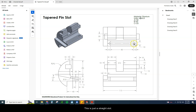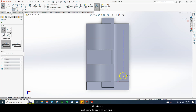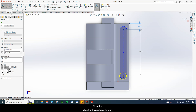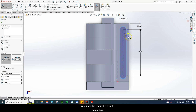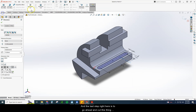The last bit we have to do is this cut right here — it's just a straight slot. You can see it's 80 millimeters wide, 10 from each edge, 10 millimeters wide. We can also see another dimension: 10 from this edge to the center. So we have lots of 10s here. Sketch, draw this in, and put some dimensions on: this is 80, this is 10. We don't even need to put that last dimension on because this is already 90, meaning from here to here should automatically be 10. Then the center here to the edge is 10. The last step is to cut this through all.